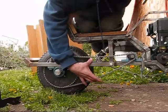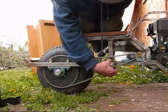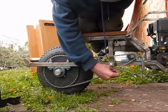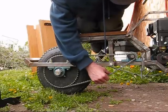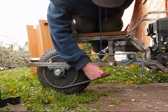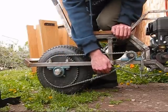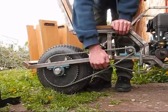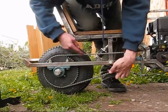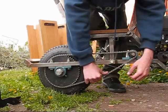So I'm trying to figure out whether I want to use a chain tensioner. It'll tighten the chain up, but see how the chain is going to be colliding with this. I'm wondering about putting some type of rail right here that the chain will go into, because I really don't want the chain tensioner pushing down. You want to put the chain tensioner on the side of the chain that's not going to have the force. The top part of the chain is going to have the force which is going to be propelling me forward, so I'm going to need to put the chain tensioner down here.